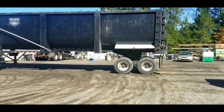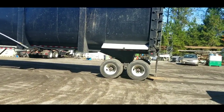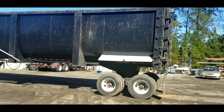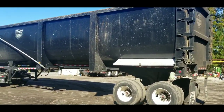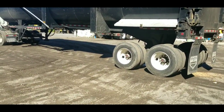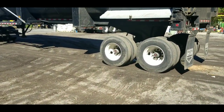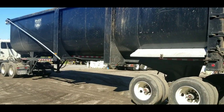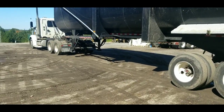For the sake of this video, we're gonna say this is where the scrap goes. We're out here on the yard. First off, you want to make sure that your trailer is level — the ground is as flat as can be. You're not parked in a hole where, when you start to move and that trailer's way up in the air, it's going to upset the trailer and turn the thing over.